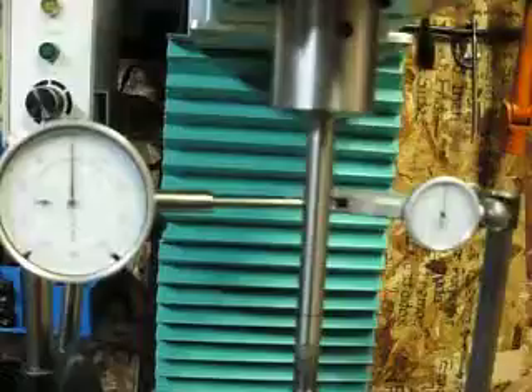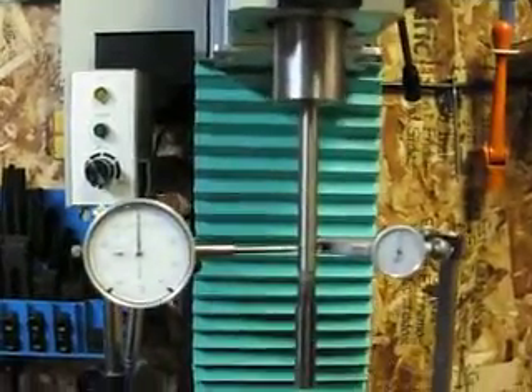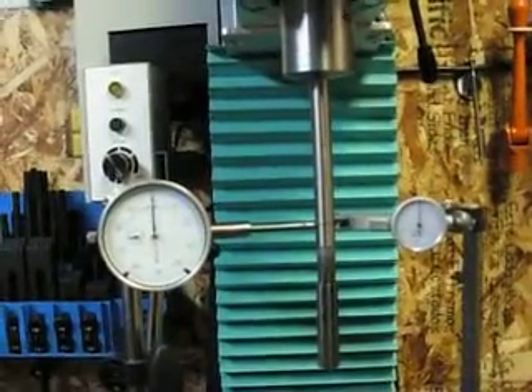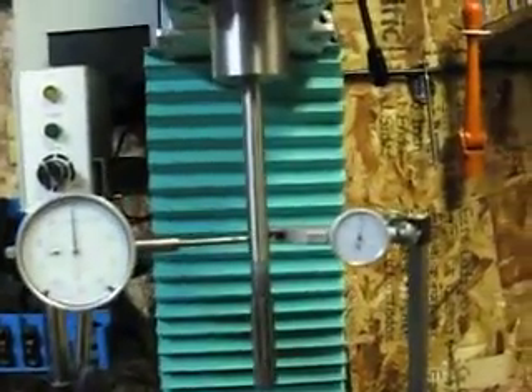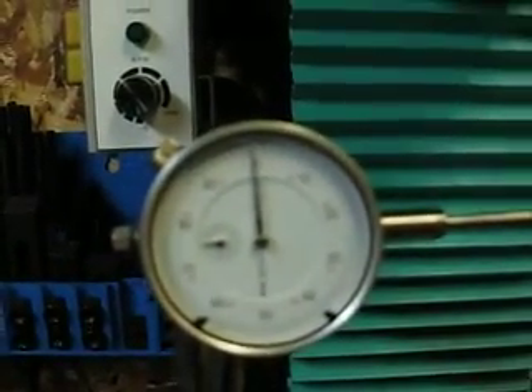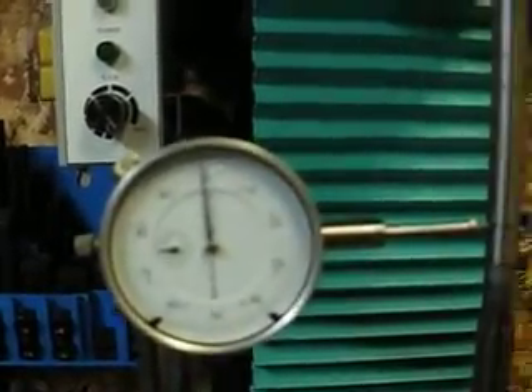If you look at my mill from up here, you might wonder what that noise is — I actually just put a counterbalance setup on it. This line's marked at 3-1/2, so I'm just going to go with that. Once again, I'm just rotating my spindle nut by hand. I'll back up so you can see the spindle turning. There is a little bit of play there — that's 3-1/2 inches down on that reamer, so you're going to expect something. On my 1 thousandth indicator, I'm running just over 1 thousandth of runout at 3-1/2 inches.